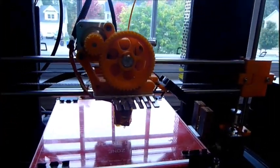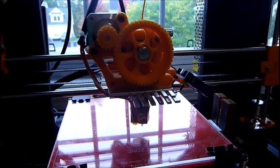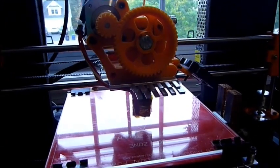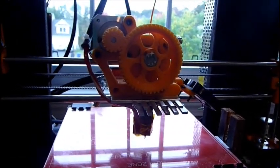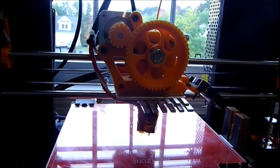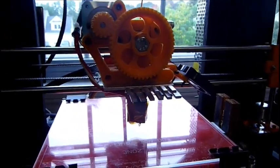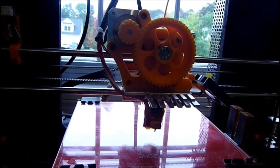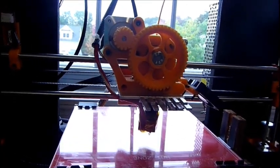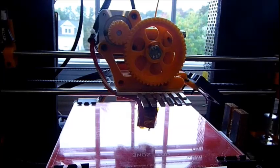I did find that my problem was the J-head nozzle came with this. It's probably not for a Wade's because it had this top brass piece with a kind of push-in clamp for the filament or something like that. So I took that off and I was using that, but there was no set screw to hold the PTFE liner in there, so I kept getting jams because of that. Basically, I just cut the threads off of that brass piece and was able to thread the hole a little bit so that I could use a number six screw with some nuts to screw it back in without having anything to grab onto. And it's been working perfectly ever since, at high speeds and everything like that, not really any jams, so that's been good.